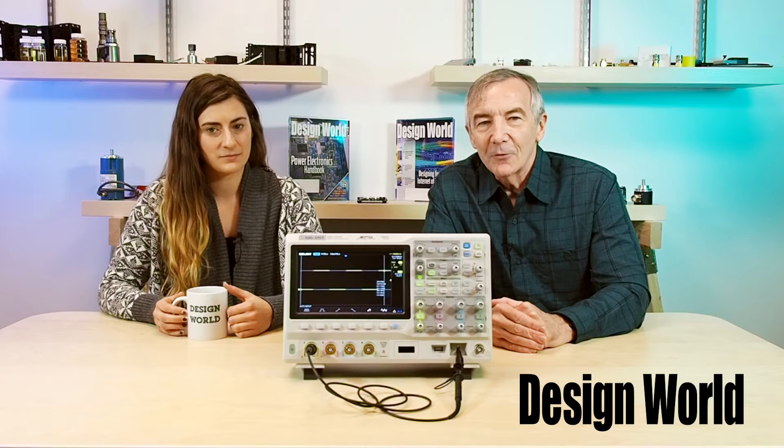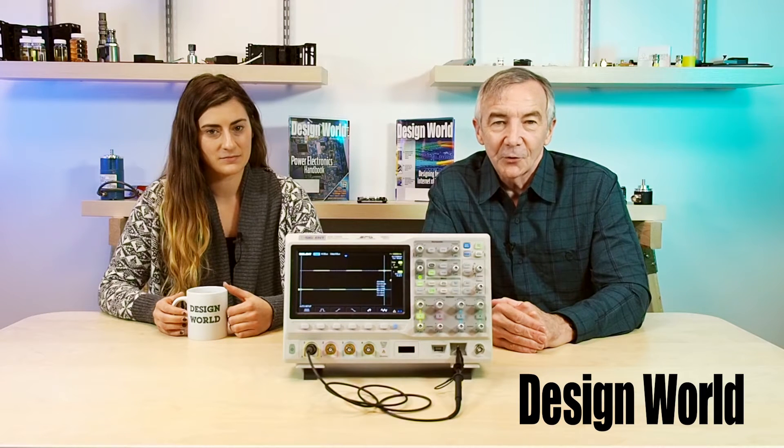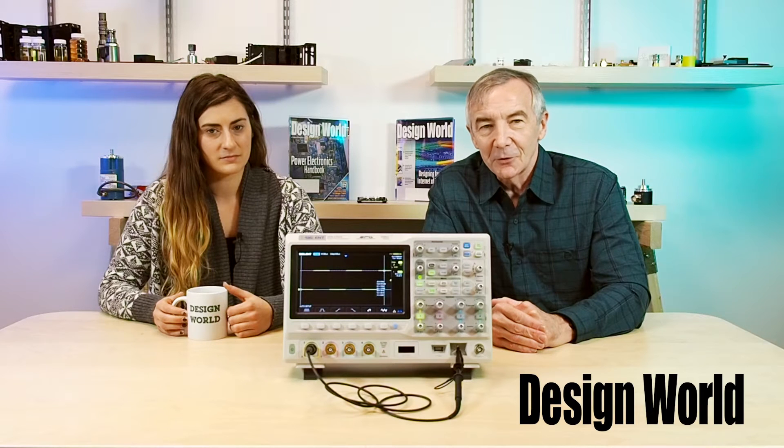Well, that must have happened just after the end of the Civil War. Well, it was a long time ago, but not quite that long. Once upon a time, I actually used phosphor storage scopes. The point of them was that points on the scope display would be more intense the more often the waveform traced through them. The way these phosphoscopes reproduce that behavior is by manipulating their displays. Each point on the waveform is stored in memory in the usual way, but the scope displays intensified waveform areas in proportion to the frequency of occurrence of the signal at each point. This has the same appearance as those displayed on old analog phosphor scopes and gives rise to the name.